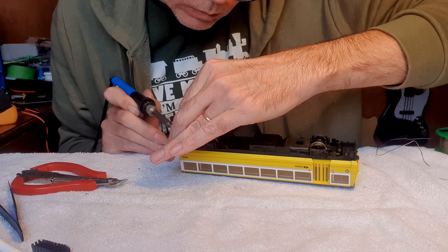I had a bit of bother re-soldering the wires to the coupling. Soldering a little bit of copper held onto plastic with a tiny little plastic rivet is very tricky and unfortunately the plastic rivet melted. Having little push-on plugs to attach to the wires and plug onto the contacts would have been a better idea — any soldering should have been off the plastic. But never mind, got it working and it seems to be fine. By all accounts the real thing was full of problems as well, so there you go. I'll get this packed up and send it back to Stephen. Catch you later folks.